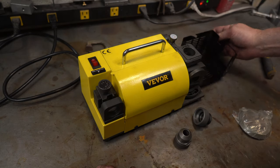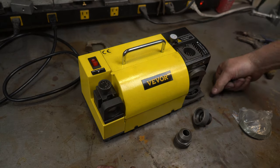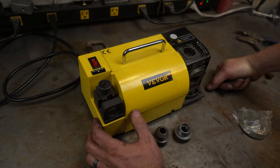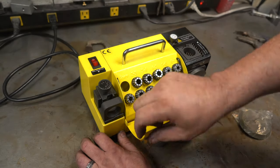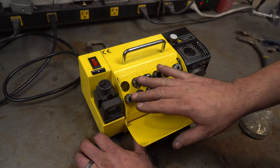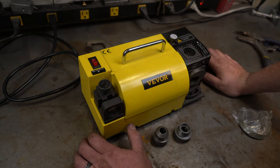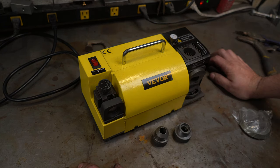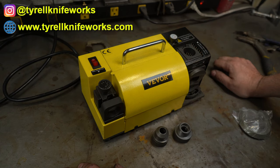Otherwise, you can open it up and change the wheel really easily. Overall, I'm really happy with this machine — it definitely sharpened the drill bits up to almost new. This machine retails at just under $270, a bit more expensive than others I've seen, but the sturdiness and the fact that it's got collets instead of just a Jacob's chuck — these hold the drill bits much sturdier and it's a really nice design. So overall I like the machine, I'm really happy to have it. It's never a convenient time when I dull a drill bit, so it's nice to have this machine to sharpen them whenever I want. Go check these out — there are links in the description for a discount. Go sharpen your drill bits!